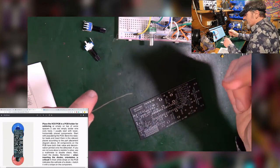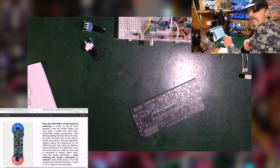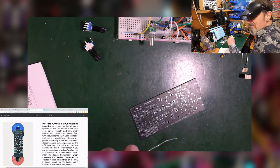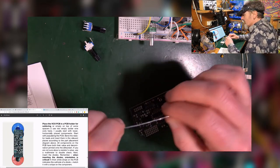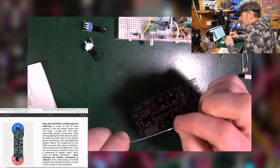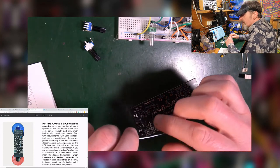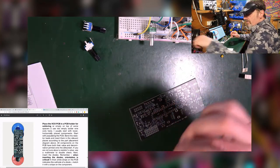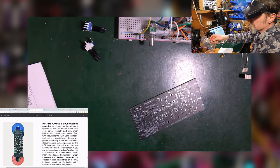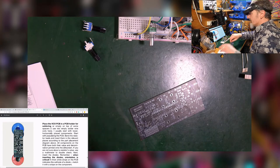0.7 seemed to be a good size, as far as I found it. It is leaded. I have tried using lead-free solder, and that does work. It just seems to take longer. It's harder to melt, but it's also a lot less poisonous. So, you know, there is that.